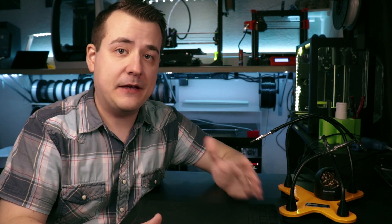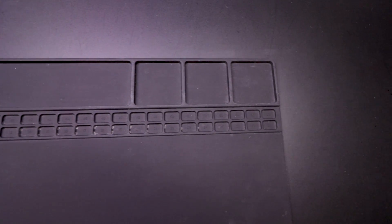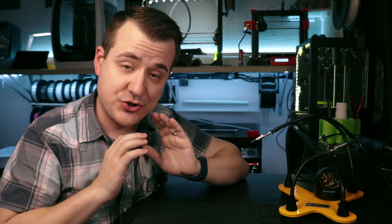This next one kind of goes along with the helping hand, so I'll go ahead and get it out of the way — and that is the surface that you're working on. Unless you're working on a really old beat-up table that you don't care about at all, you're probably gonna want to have some kind of mat underneath whatever you're working on. What to look for might not be so obvious. By far the best kind of mat I have found is a silicone mat. It's incredibly resistant to heat, so if you get your soldering iron tip too close to it, or a hot air gun, or even drip some molten solder on it, it's not gonna damage it and it's gonna protect the table underneath. Additionally, virtually nothing will stick to it — paint, glue, even molten solder once it hardens — you can pretty much just peel it right off and wipe it down with some alcohol and it looks brand new. A lot of them also have pockets at the top to hold screws, and some of those even have a magnetic strip to hold the screws in place.